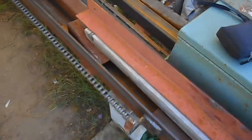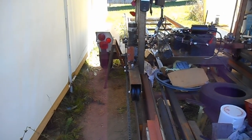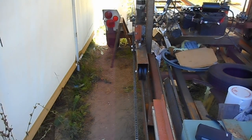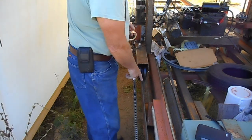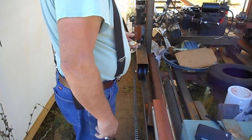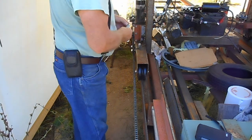Got my motor on. I got two batteries over there. Unfortunately, the batteries I don't believe are any good anymore. All I'm trying to do today is determine how fast this thing will go with an 11-tooth sprocket on that motor. I'm going to charge it up. From here to this spot is 24 inches, so it's going to tell me how fast this thing would cut an 8-foot log.